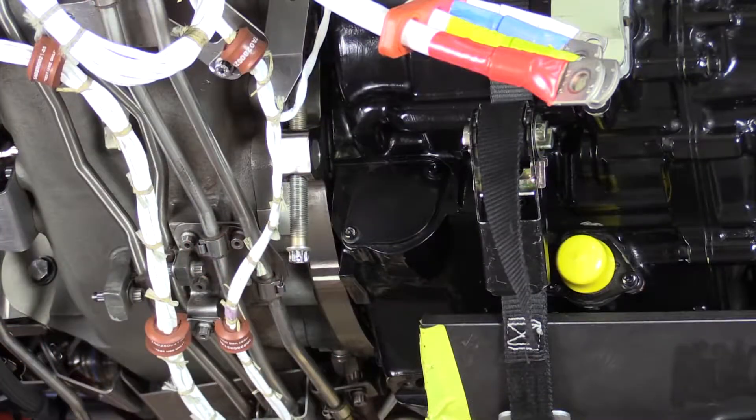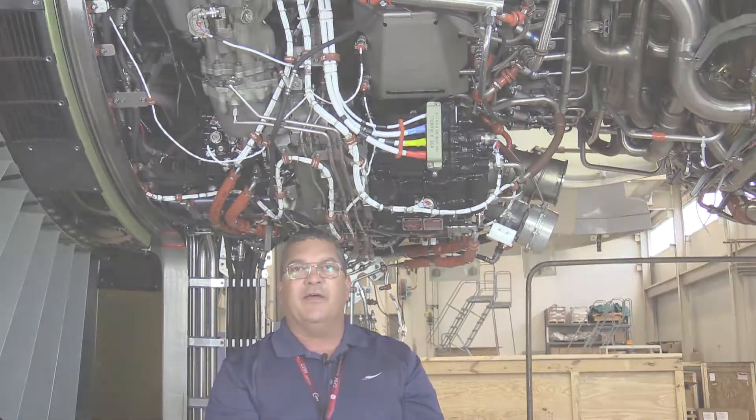I can't stress enough the beauty of this tool — it does all the hard work for you with the pitch and roll adjustments. If you're patient and you look at the quad ring and face plate relationship 360 degrees, make adjustments, try it, adjust, try it — that takes a lot of the risk out of installing the IDG. Those are the details of IDG removal and installation I wanted to point out. Hope you enjoy the Maintenance Minute and I'll see you next time.